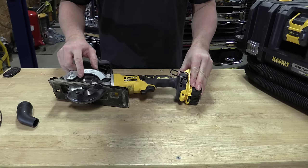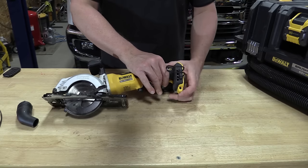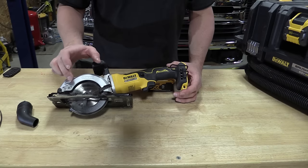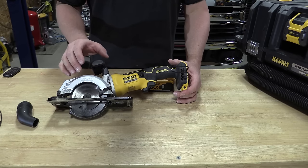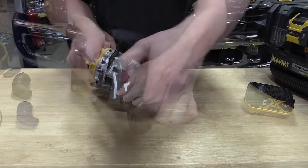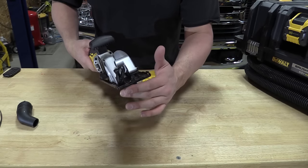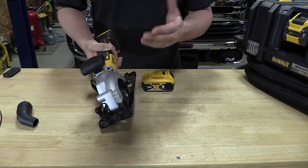This is a four-and-a-half-inch circular saw with a three-eighths-inch arbor, so finding blades for it at the Home Depot can be fairly hard. I'll leave some links in the description so you can see a bunch of different blades I've ordered, because I see a ton of different uses for it — but this 24-tooth blade needs to go. When using this you have an inch-and-a-half depth of cut at 90 degrees. The saw is capable of beveling to 45 degrees, and you do have a screw so you can adjust your 90-degree stop.